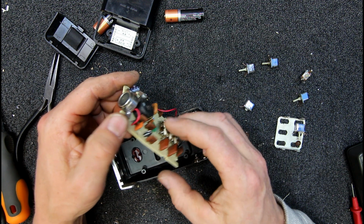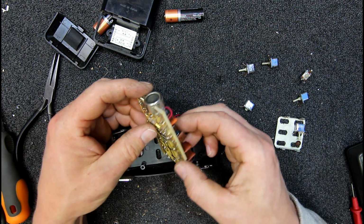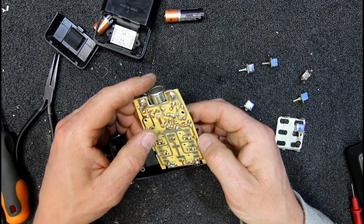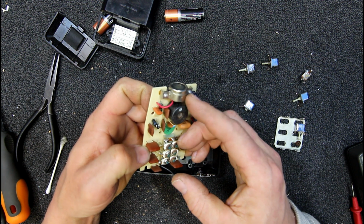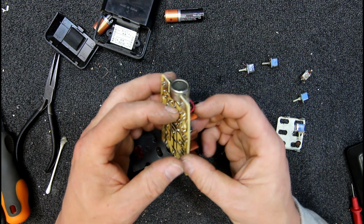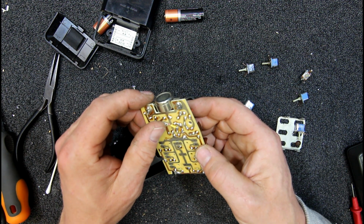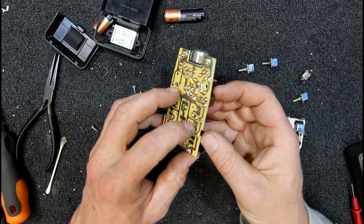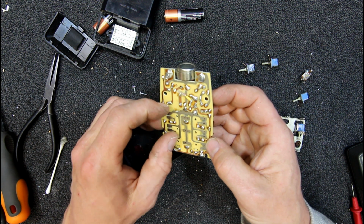And our neon, I wonder if that's just running off a separate coil inside this thing. Actually, through a 470k resistor to ground. Yeah, I tell you what, that oscillator thing, but that's actually coming... It's another resistor. Where's this actual transducer hooked to? One side to the ground, one side to here, which goes to a capacitor and a resistor. Yeah, capacitor back to where this neon is. And that's also this line that comes around here. Oh, connects to all the different capacitors. And then to ground through the switch.